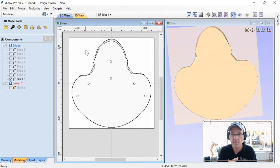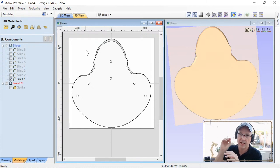Now, I'm going to talk about these dowel holes for a second. All the rest of the dowel holes are actually going to cut right through those parts. These 6 are not. They're only going to go halfway through my material. That way, I thought it would be smart to do this, so I could push the dowels onto the backing and they wouldn't show out the back. In hindsight, I may or may not have been better off cutting all the way through. That way, those dowels could just be pushed through the back side.